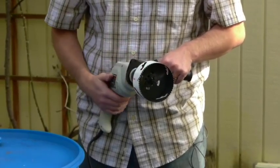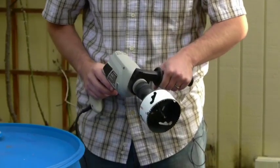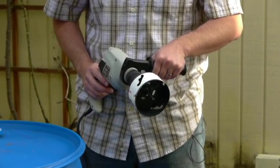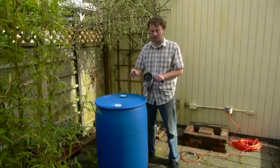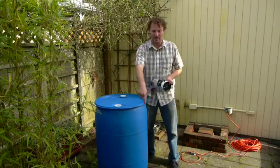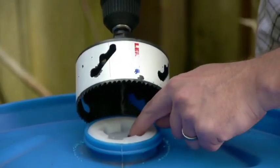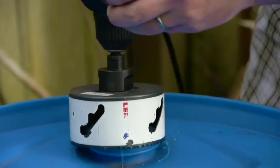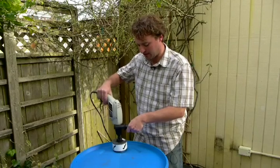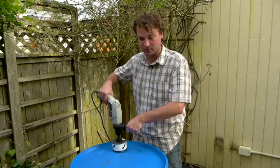You need to be very careful — this hole saw is very sharp. It tends to buck when you start drilling, so you need somebody strong and preferably experienced with these types of hole saws when drilling out your bung. Then I'm going to switch over to a seven-eighths inch spade bit to do the holes in the side and in the bottom. When drilling out the bung, make sure the pilot bit goes right in the center of the cap, drill down a little bit to secure it, then brace yourself for drilling the actual four-inch hole.